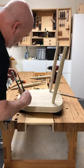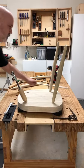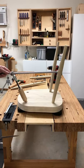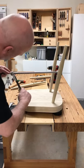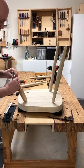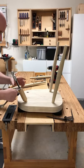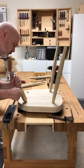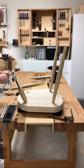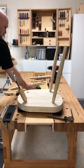Looks pretty good. What I like to do is put the extension through and point it generally where the mortise is going to be, then see how you're going as far as halfway — that looks pretty much perfect. Tighten that up. Turn the one down here up just a little bit. Get this pointed in the general direction of the leg. Give it a couple of whacks with the soft end of the mallet just to secure it, and we're ready to go.